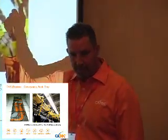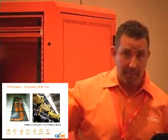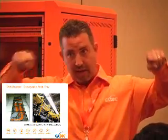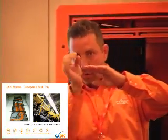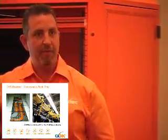Now, just a piece of advice for best practices. I've seen a lot more people going to overhead, which is great. It's a great solution for those particular things. But one thing you want to keep in mind, if you're putting fiber jumper cables up overhead, make sure that it's in solid tray. I've seen a lot of occasions where people are laying jumpers on top of ladder rack. And remember we talked about earlier, anytime you put pressure on fiber, put bends in fiber, you're creating loss points. What happens is the fiber over time starts taking the shape of every ladder rung, cross fence thing in the ladder rack, and it's creating loss points at every particular junction. So keep your fiber away from your copper up in those ladder racks and make sure that it's in solid tray.